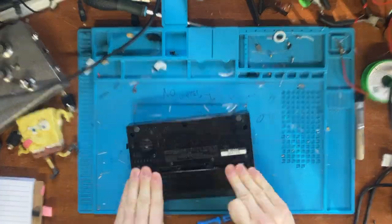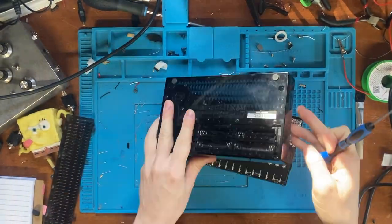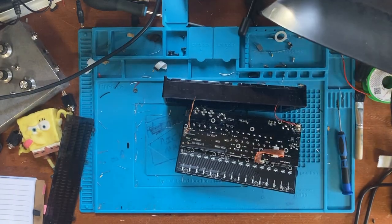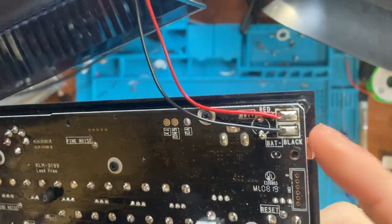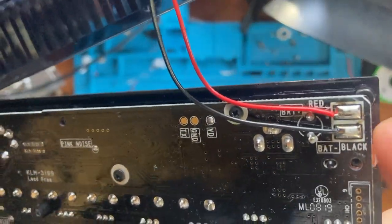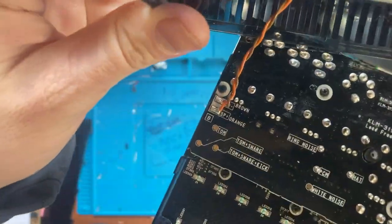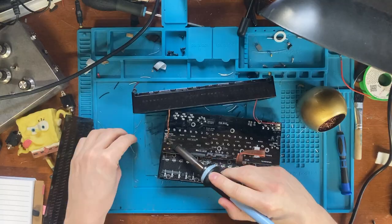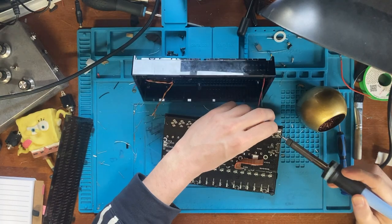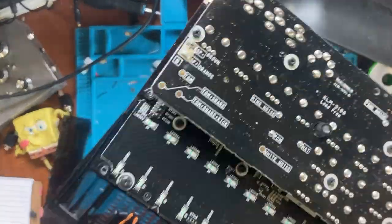First thing you've got to do is unscrew all the screws on the back of the Volca Beats and the one inside the battery compartment. Leave the three surrounding the speaker alone as the speaker can stay connected for this mod - that will expose the PCB. At this point you can see there are four wires connected to the PCB in the enclosure, so you want to remove those so we can open it up and look inside more easily without putting any strain on those wires. You unscrew those and then you'll see we now have a completely separate PCB, which makes this mod so much easier to do.